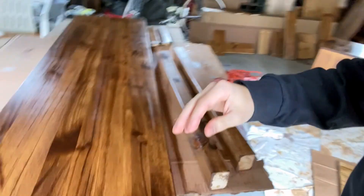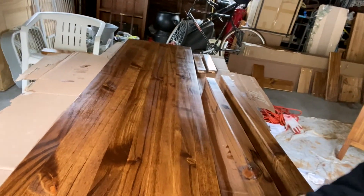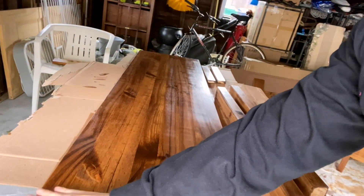So we are on day three of this project. Yesterday, Luba sanded everything and we put the second layer of poly, and today it looks really nice. It's nice and smooth, but there are still some places where you can feel it's a little bit bumpy. So what we are going to do, only on the top layers, is sand it and then put a third coat of poly — and you will see the results soon.